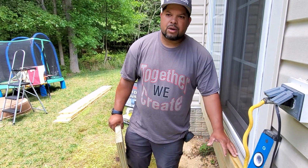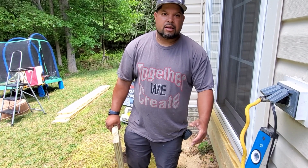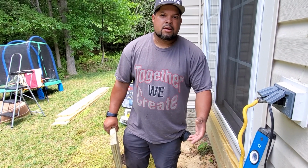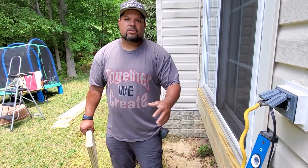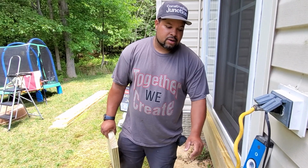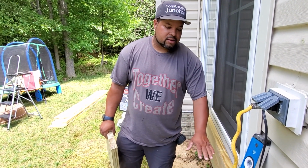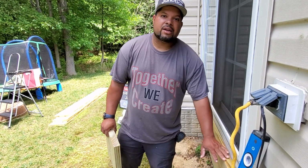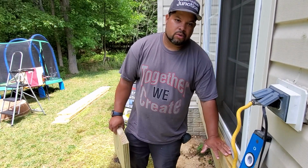What's typical, you wanna be around 10 inches. The average shoe size in the world is 10 inches. Most people are either a little lower, a little higher. So 10 to 11 is the range that you want to be in. And keep in mind with the tread, you're going to have a little bit of a hangover. So you want to set your stringer at 10. It'll end up like 10 and a half or 11 once you put your tread material on.